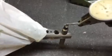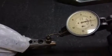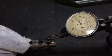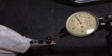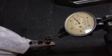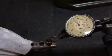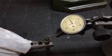I need to be a bigger rad than my indicator states. From here I'm about two thou, almost two and a half thou higher — which is good for me, because the wheel's going to wear out a little bit and that rad might get a little bigger. But I'll redress it and do a second cut after I do all my roughing cuts. Hope you guys enjoyed.